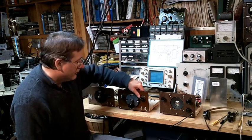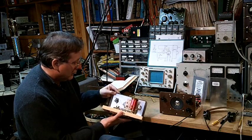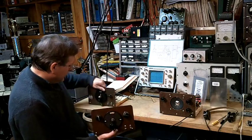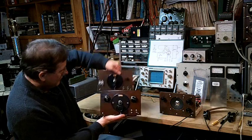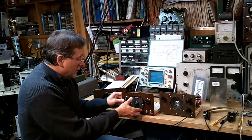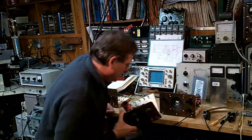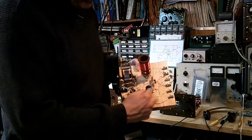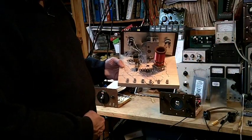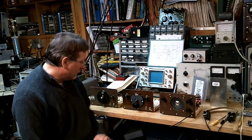So why not go all the way and put a metal plate on the front panel? The other obvious improvement is that the two trimmers are gone — you can see they've been replaced by a knob, and that makes a very nice control compared to trying to use a screwdriver on the two trimmers. I've actually installed a socket in this receiver that will accept a shield. The hand-wound choke has also been replaced by a store-bought choke.